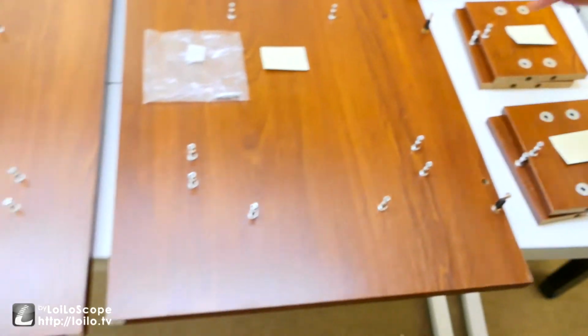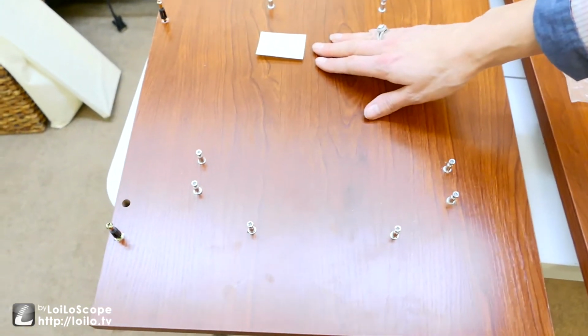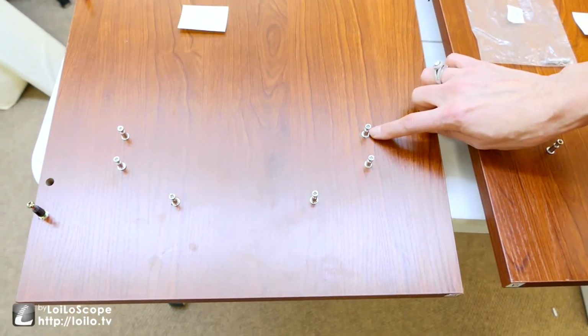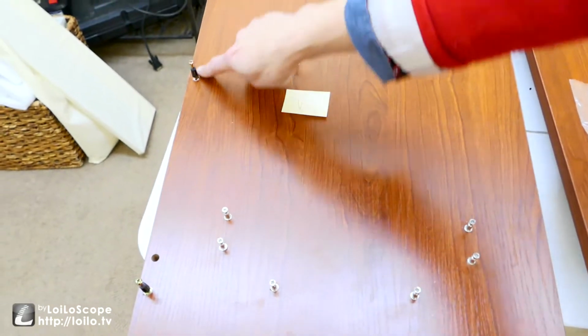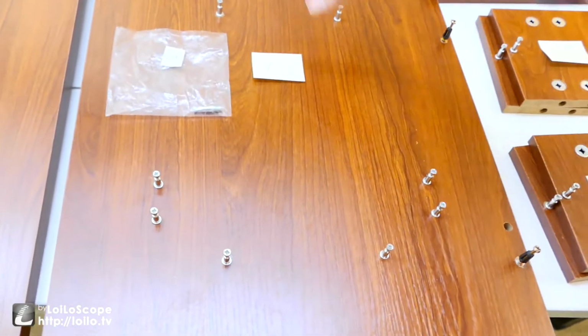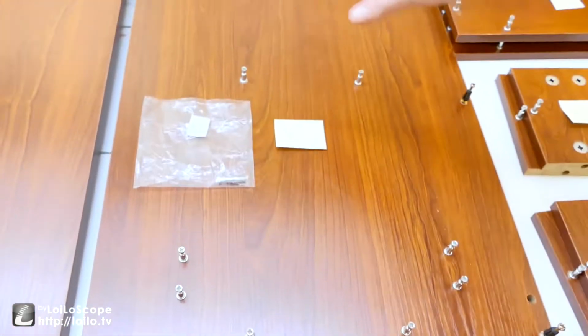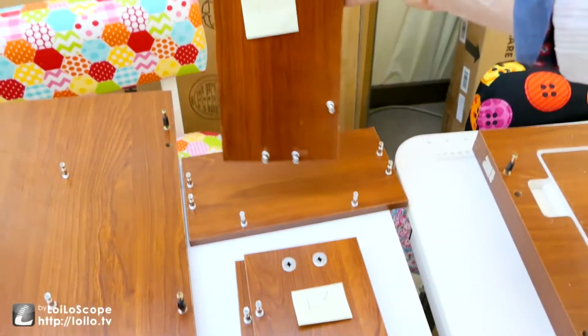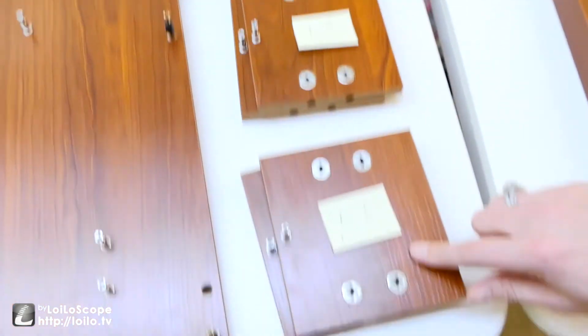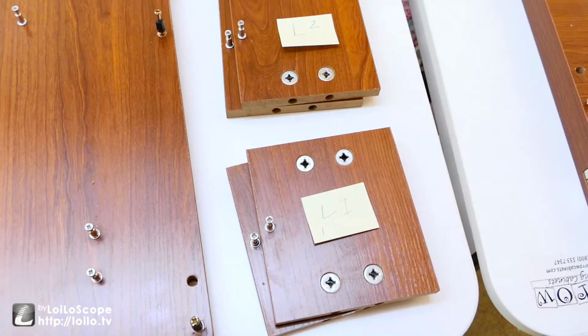And we'll go panel by panel here. On the V2, there are 10 total. These ones will actually go into the wood holes and not into the metal holes that you put your C1s in, but 10 there. On V1, again, 10 kind of all in the center here. On your L panel, it's 6 total. And on each of your L2 and L1, they're getting 1 on each.